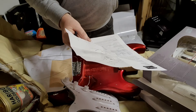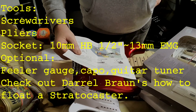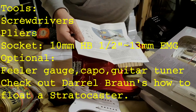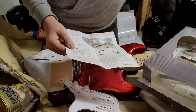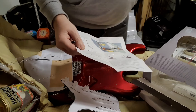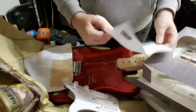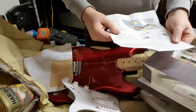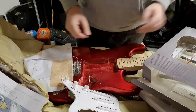Output noise is minus 91 dB at 60 Hz — well, I'm at 50 Hz because I'm British, so maybe it doesn't fully apply. You need a battery. The only tools you need are a Phillips screwdriver and a half-inch hex nut driver. The pickups and controls are pre-installed on the 11-screw pickguard and should fit into any Strat-style guitar. With strings removed, unscrew the existing output jack, unsolder or cut the two wires, and install the 12B stereo jack included in the system, with spring terminals pointing downwards as shown in diagram one.